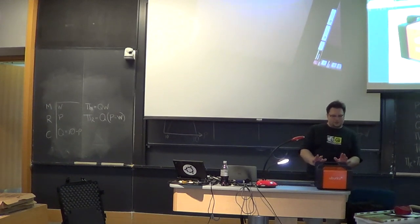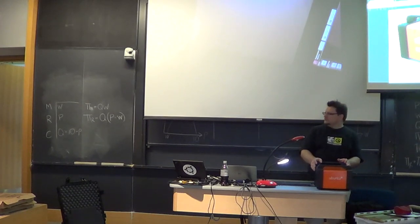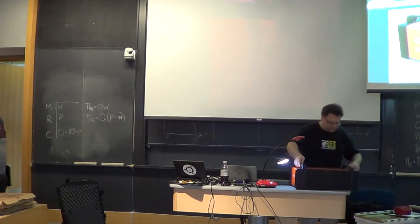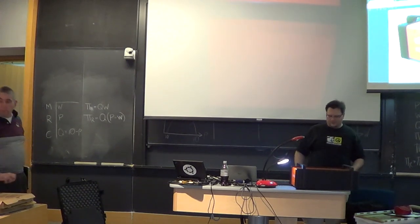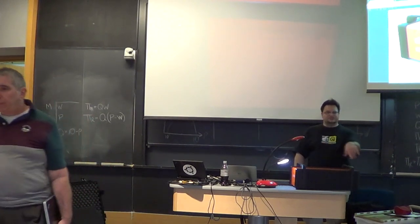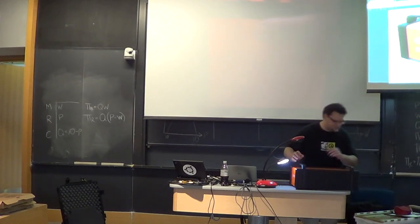This is actually quite heavy because it's basically a heatsink. The case itself is the heatsink for all the machines. Looks the same on the other side. And the compute units are aligned on the sides so that they radiate directly here. If we turn it on, you would see blue LEDs on the sides, which are the reset pins for single units. So this is fanless? It is fanless, except for the switch. Nice. Last time I saw it, the switch was not fanless.